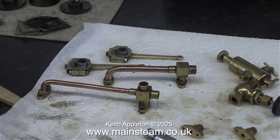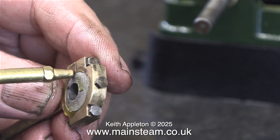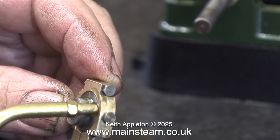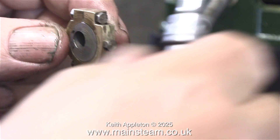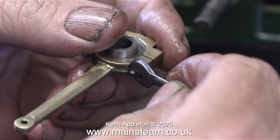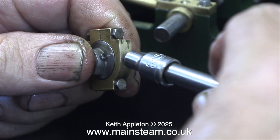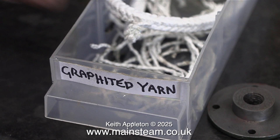In actual fact, some of the jobs took quite a while. After oiling all the parts, I replaced the bolts in the ends of the eccentric straps, which locate in grooves on the eccentric sheaves. I checked the tightness of the bolts in the eccentric straps and everything's fine. This is a very common way of mounting eccentric straps to eccentric sheaves.